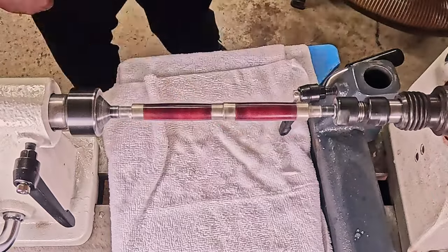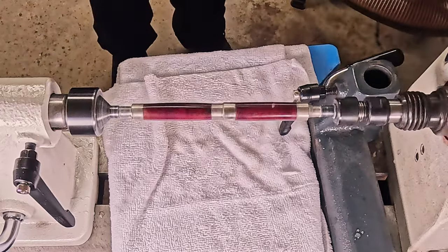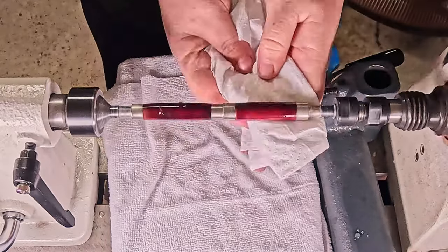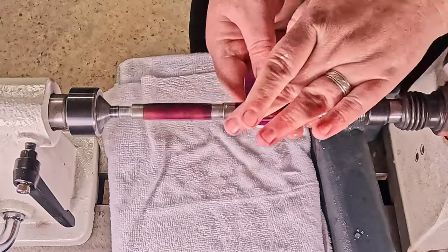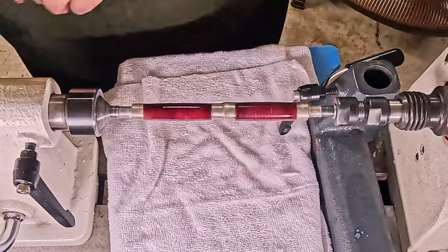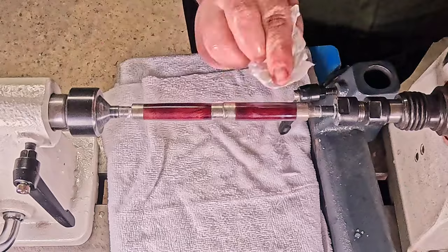You may notice I touch it first and then come back for a second pass. What I'm doing there is adding moisture, because if you don't you're releasing plastic into the air — it also heats it up and can ruin the finish. So first I make it wet, and then I come back with a freshly wet micromesh.